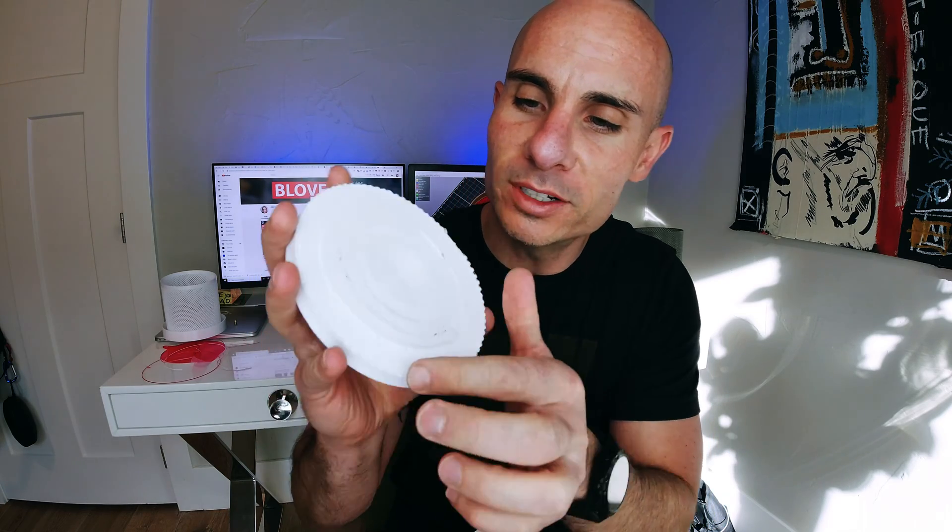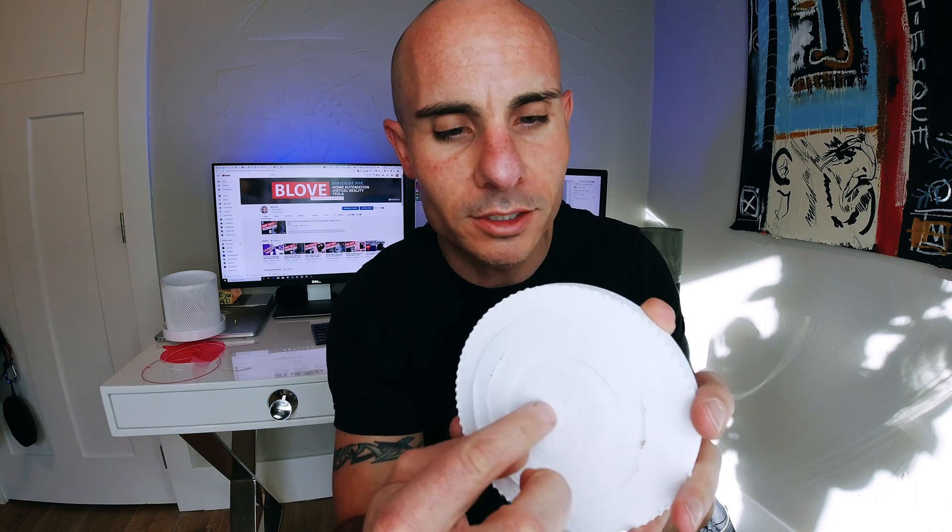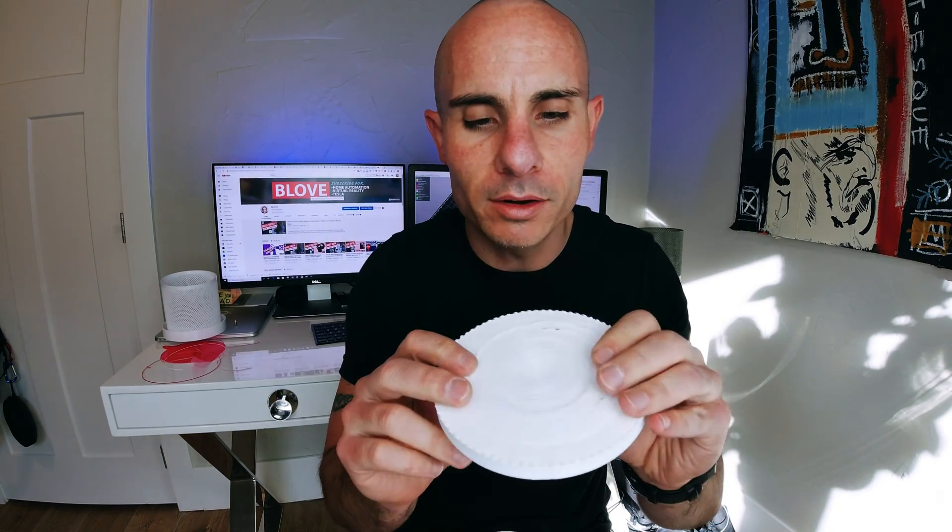So what did the mistakes look like? Along the way I started doubling my print speeds — doubling my infill speeds, layer speeds — changing a lot to try and get the most out of each print. So where I started was this one, and oh boy this one was a big fail. I had the settings set very high for the layer speeds, so this top layer was done so fast. It lays down the top layer in one gigantic Archimedes spiral and the print head was moving so fast through the PETG that it actually started cutting it — the top layer just started peeling up.